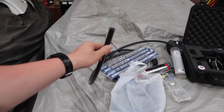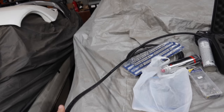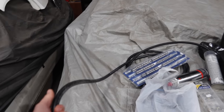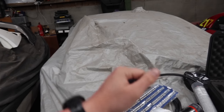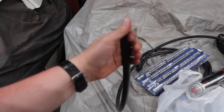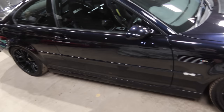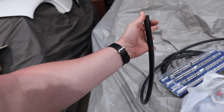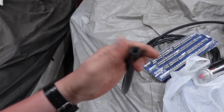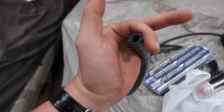So the problem I had, the fuel hose and this hose, which is marked as heater hose, have different ratings, yeah? And this one had the higher temp rating, so I thought, oh, that'll be fine. None of them specified hydraulic oil as being something they could take. So it was either fuel hose that would go up to 100 degrees, or heater hose, and they said it'd go up to 150 degrees or something like that. So I thought, higher temp rating, right? I mean, it's almost definitely not suitable for the application, but I don't see that we have a choice.